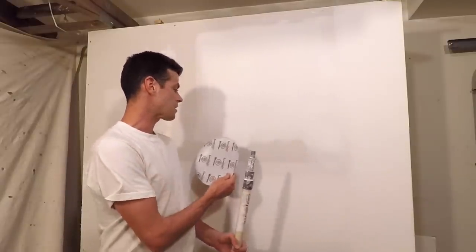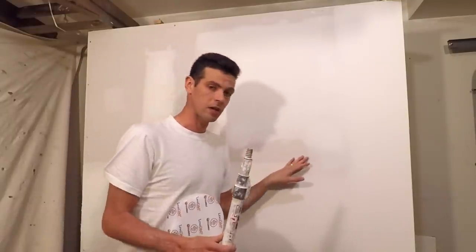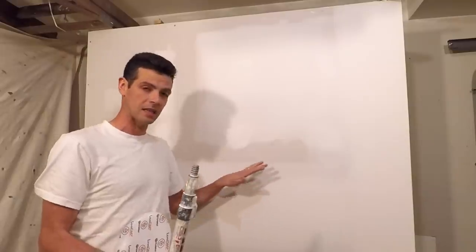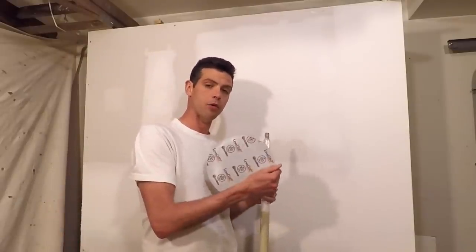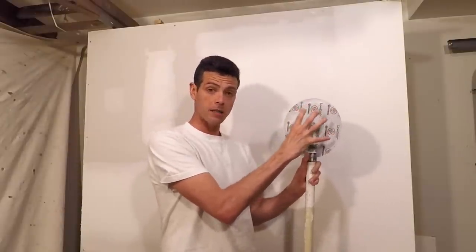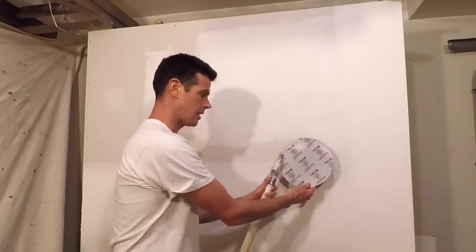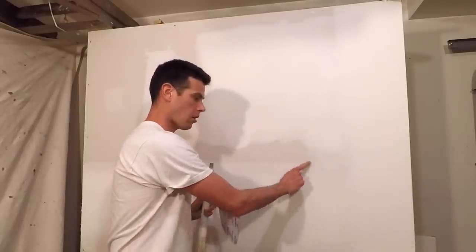The other thing I find is that while yes, they are great for large surfaces, I have difficulty actually feathering an edge. When I'm trying to burn down my feathered edge right here — which even as smooth as it looks takes a couple passes — I find that I can't push hard enough. Because the pole is in the center of this broad surface, it spreads the effort out too much, so you just can't push down really hard.